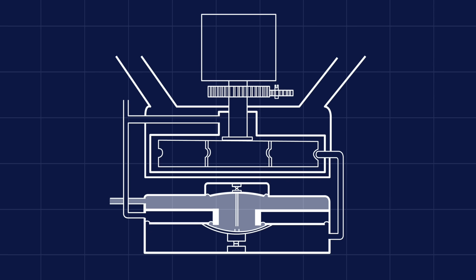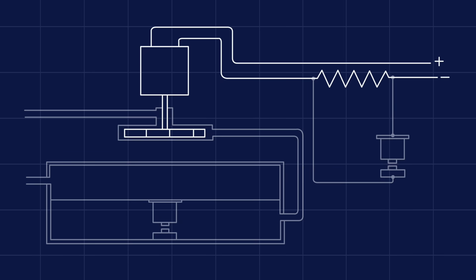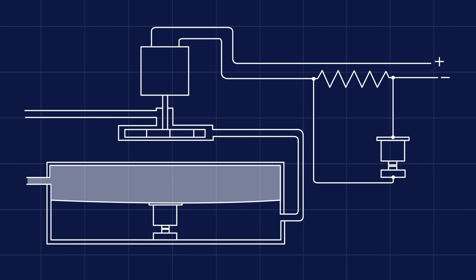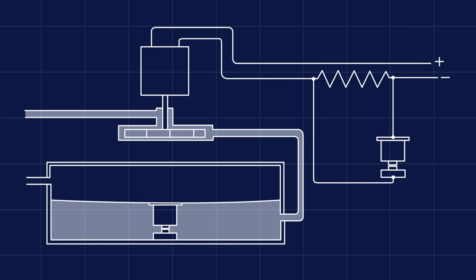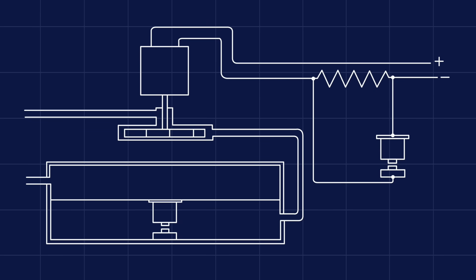So long as the aircraft remains above this airspeed, the whole system will continue to operate. From this point on, the system is controlled by the lower high-speed diaphragm. Once the system starts up, power to the motor passes through a bank of resistors limiting its maximum speed. As the aircraft accelerates, pitot pressure in the upper compartment increases, deflecting the diaphragm until the electrical contact closes. This, via the vacuum tubes and electromechanical relay, closes a set of normally open contacts that short out the resistor, supplying full power to the motor and causing the fan to accelerate. Eventually the fan pressure counters the pitot pressure and the contacts reopen, reconnecting the resistors and limiting the fan speed. This creates a negative feedback loop, causing the motor speed to hover around an equilibrium point proportional to the true airspeed of the aircraft. This speed is transmitted to the API via a flexible rotating shaft.